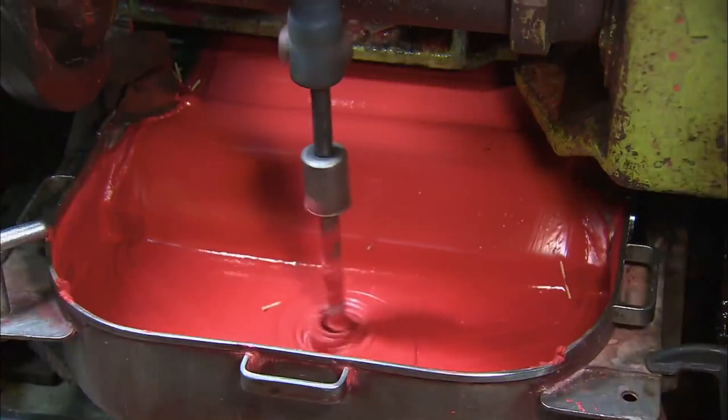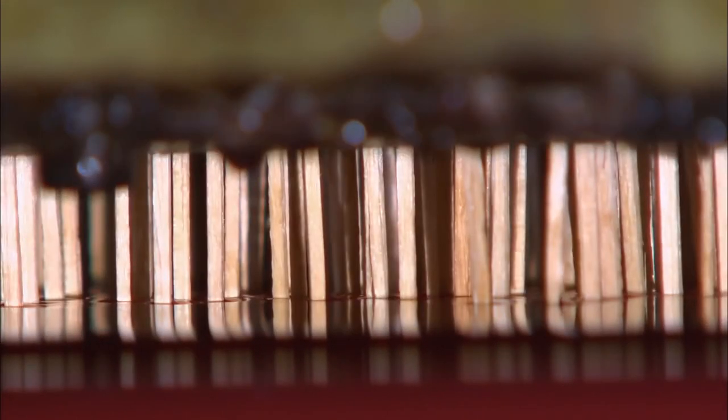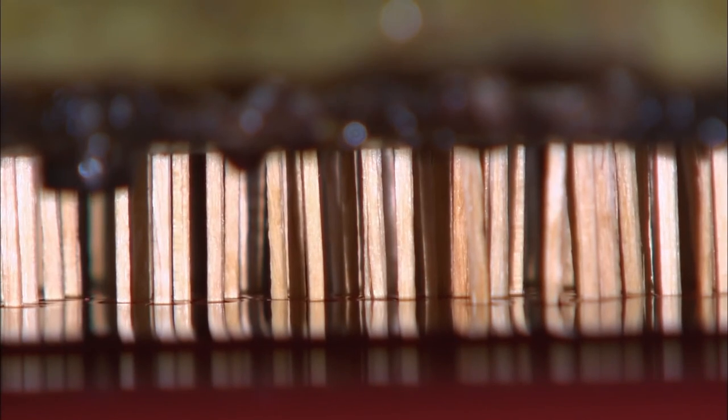While a mixer prevents the match head compound from solidifying, the loaded match bar lowers the splints and dips their heads in. After 5 seconds, the match bar moves back up, and the head compound mixture flows down into the mixing pan to be renewed before another section of the match bar moves in.